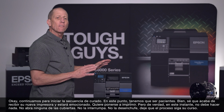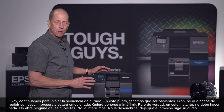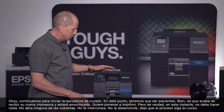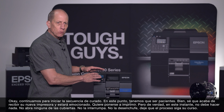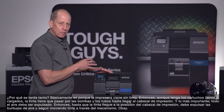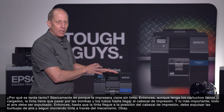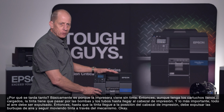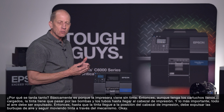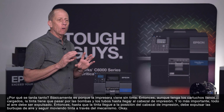And at this point, we have to be patient, okay? I know we've just got our brand new printer, we're excited, we want to play with it, but really at this point, don't do anything. Don't open any of the covers, don't disturb it, don't unplug it. It's really got to run its course. And why is this going to take so much time? Basically, the printer ships completely empty of ink. So although we have full cartridges in there, I've got to get that ink past pumps, into lines, all the way up to the printhead. And more importantly, I have to get all of the air out.